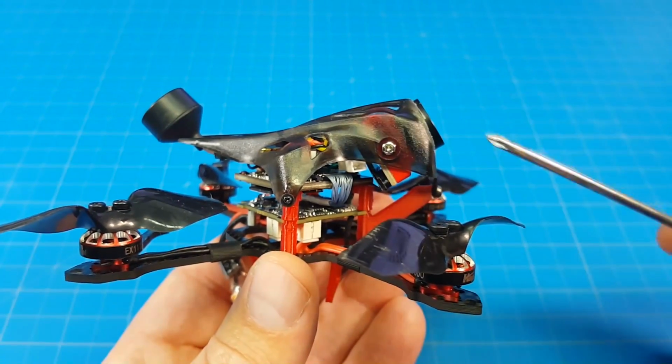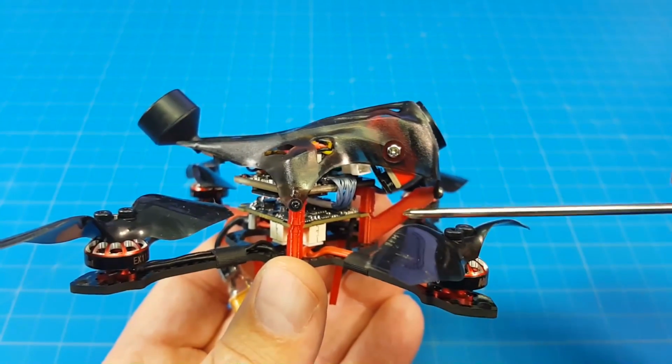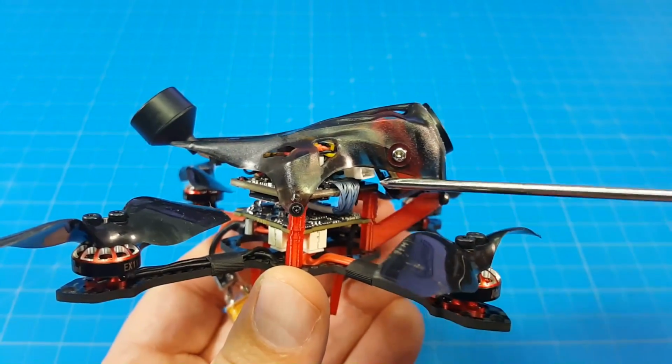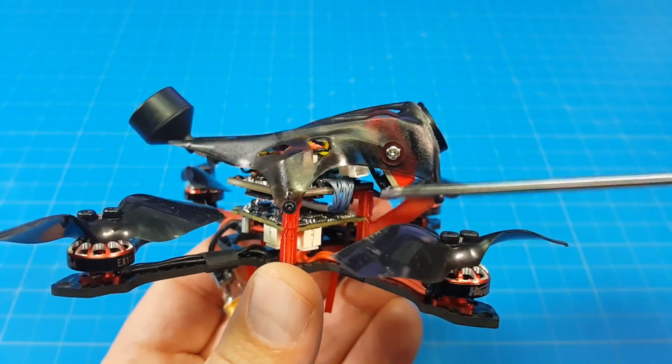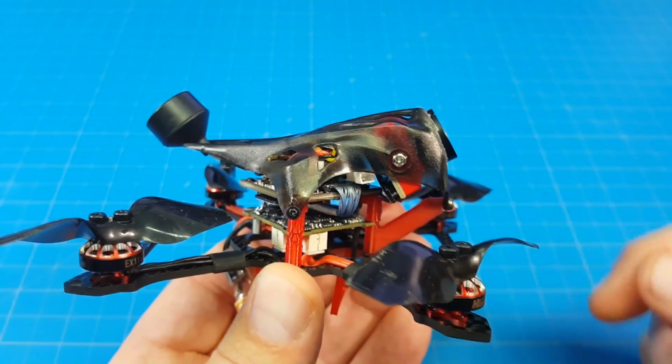That's what I've been doing on other quads on the side, is making sure our mounting system for the camera, if it's got TPU involved, that I try to mount as much down to the carbon fiber and use a screw with a nut on it. That way I can increase that pressure and firm up that mounting, because when you get any wobbles in flight, it comes out in the HD footage.